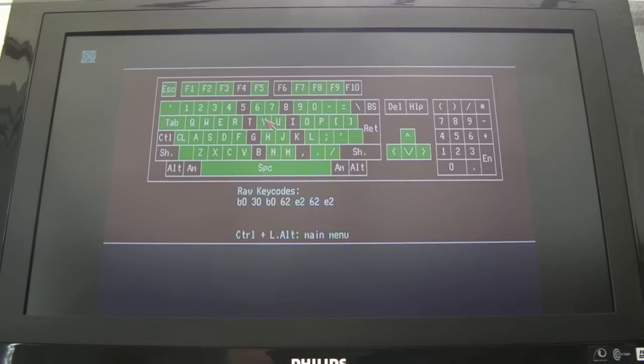So this is the following morning. I've spent a few hours this morning scoping various things here, and I'll show you some of those in a minute. The keyboard MCU. I focused on the keyboard issue because I was getting nowhere trying to understand the random nature of the red screen and the black screen, and then it seeming to work but the keyboard not working. So I thought, well, let's just focus on the keyboard, because the keyboard is a clue. The keyboard may be the answer.